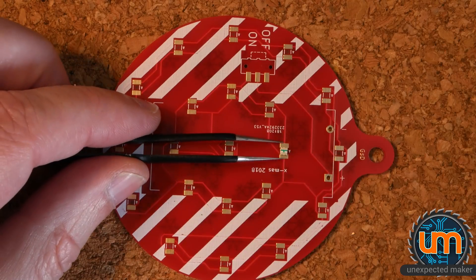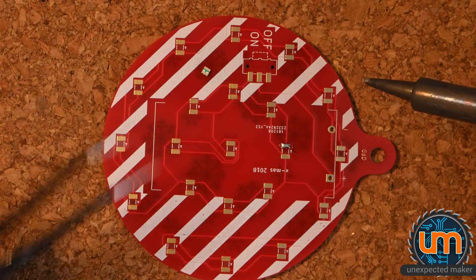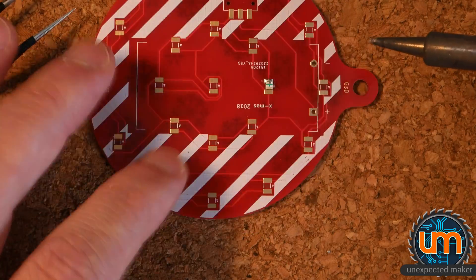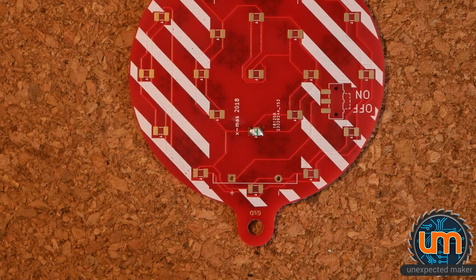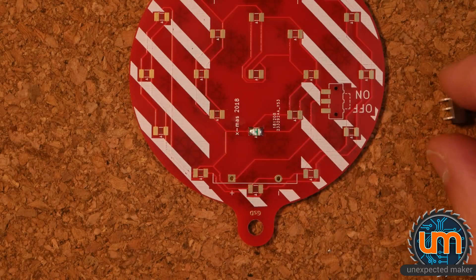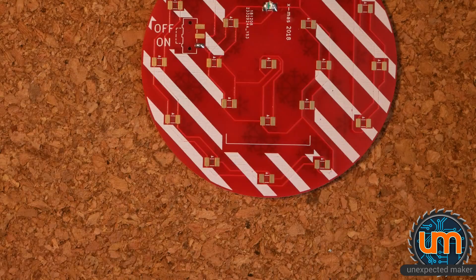I know a few people have done PCBs with upside-down LEDs. I have not built one before, so this could go very bad or very good. I'm super keen to see how this turns out. I'm just going to start with one, see how easy it is to put on. I should get some thinner solder — it's quite thick. Because the LED is going to sit slightly above due to the package size, I might need to use even more solder. It's also an interesting slide switch — it's quite large, larger than the ones I normally use, but it's only three feet. Let's get some solder on these pads. It's got nice registration holes — put some pressure on it to make it go flat when I solder it.